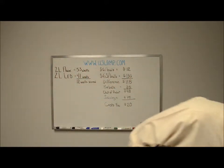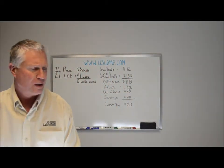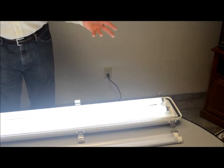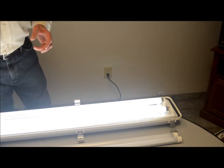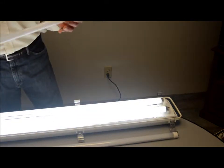I'm going to flip this fluorescent fixture on — this is a standard fluorescent fixture. With the previous bulb I showed you, you remove the lamps, remove the ballast, and hardwire the electrical power to the lamp holders. The lamp holder manufacturers do not recommend that, nor do they warranty it.